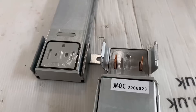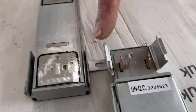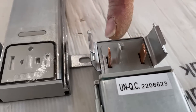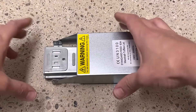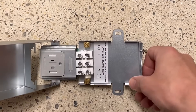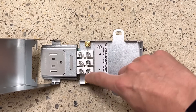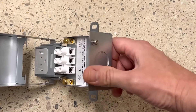Looking underneath the length of power track here, you can see at the intake end it has these pins sticking down, which serve a dual purpose. They can either connect to another length of track to extend the length, or they can be used to connect to the feed unit. Inside here there's a chunky terminal block that can take up to 16mm² cable and also has two earth terminals either side — perfect if you're using three-core armoured and you need to bond the armouring.